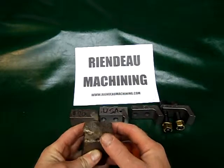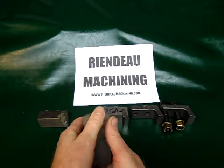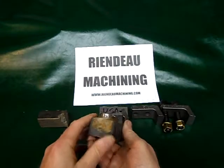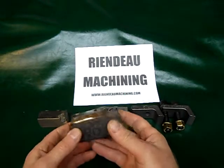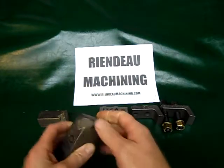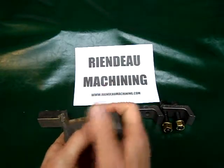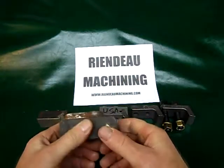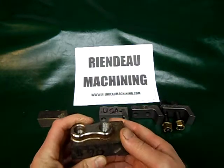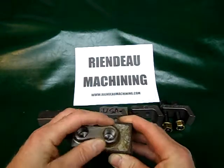This tooth does a pretty good job of mulching into the ground. Here's another one that's in good shape, but they're 90 bucks. You can see that they're not very sharp — they wear well but they do not cut well. You just beat the material up into submission and beat it into the ground. A lot of horsepower is used for this. You need a bigger skid steer or pretty good horsepower on your excavator to run that.